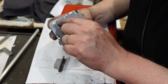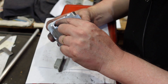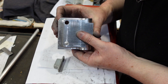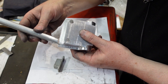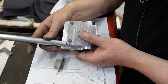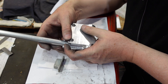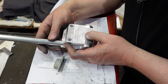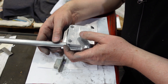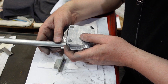These holes here — eventually I'm going to be cutting through there to leave myself basically a 4mm flange through here, lighten the whole thing up and make it into a proper clevis. But before I do that cut, I want to get a piece of tube and weld that on. Once that's welded I can finish off a few corners and cut that out. I don't particularly want to weld it with it cut out because it may distort slightly, so by leaving that bit in and letting it cool slowly it'll basically look after itself.